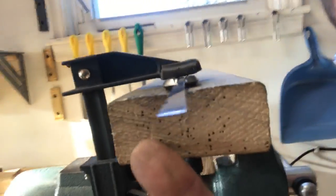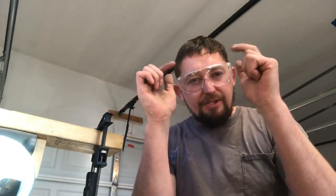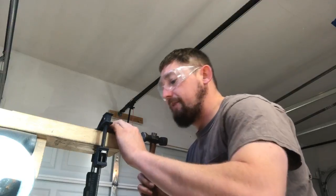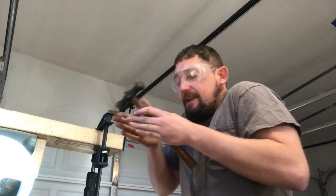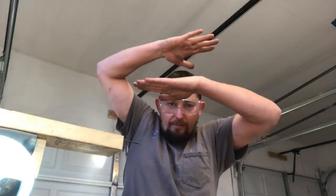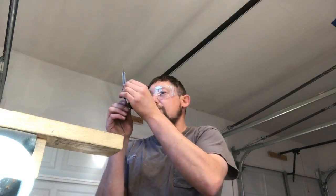Okay, we got our relief cuts in place, and this is gonna make it way, way easier. See them there? The two cuts I made next to there? Way easier to crimp that so that we're just crimping over some little ears besides warping the whole frame around it. Now, I've done a lot of vibration here, so I'm gonna make sure that we're still drove in because I want the tension of it fitting like a puzzle piece to help hold it, as well as the crimp. I never want to cut a bigger channel than what I need and then just rely on the pressure of the crimp. I want the sides and everything closed around it because those things will rob you of your sound.